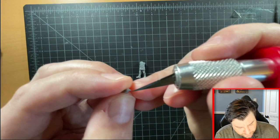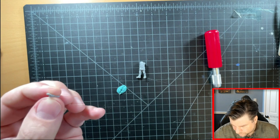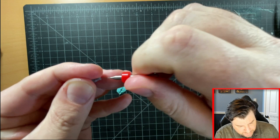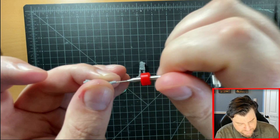And then simply what I do is I get a drill. I'm going to use one of the smaller ones, but not the smallest because it will just break off. There we go. And all I need to do is put it into the pilot hole and then start drilling. Turn it by hand very carefully just to get it started. You do need to apply pressure, but the secret really is to take this very, very gently.